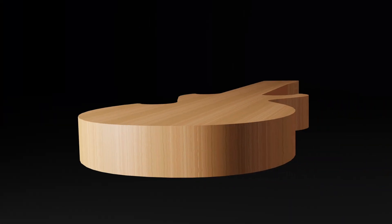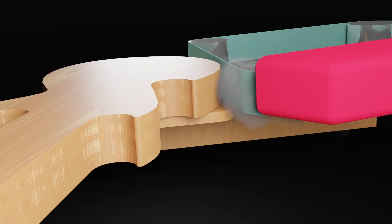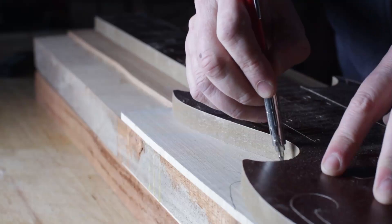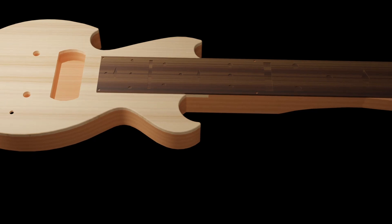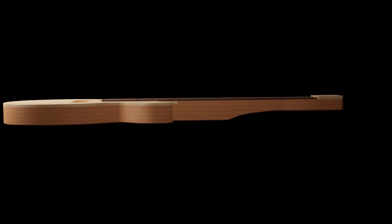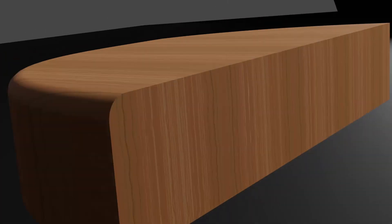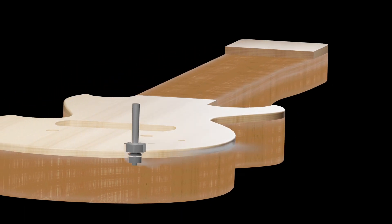Although the effects of doing edge work on the CNC may appear insignificant, for those who enjoy this combination of art and science, noticing and taking pleasure in these subtle details is what it's all about. Even though we cannot measure them without tools, our senses can instantly perceive even the slightest inconsistencies. If I use the CNC to create edge work, what will happen to the shapes as I refine and sand out tool marks? In this graphic I have exacerbated the material removal a bit — 35 thousandths of an inch, a bit more than you would generally remove, but not by much. In this case we have added a point to the contour that the player quickly feels and sees. If the sides are sanded free of tool marks before the roundover is cut, this would not happen.